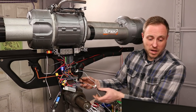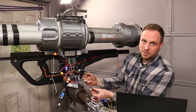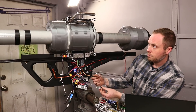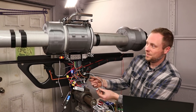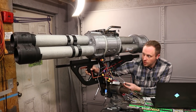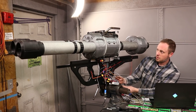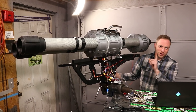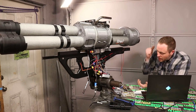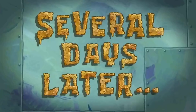After a little more tuning and fixing a small bug in the code, things are working and we're getting it dialed in. At 3000 acceleration and 30 RPM it's starting to sound pretty good. Bumping to 50 RPM seemed a little over max speed — it just needs a tiny bit more engagement so it won't sound like it's tearing itself apart.